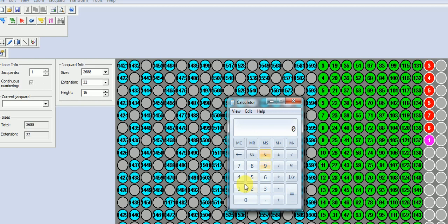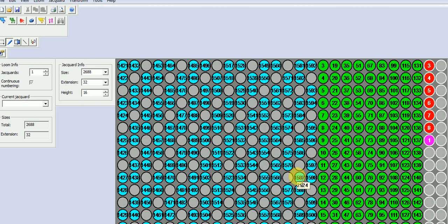84. Same, 1600 divided by 14.2 inches, you get 112 ends per inch for this. We also saw 800, divide with 14.2, how much you get? 56 ends per inch you get. Like this you can calculate, and you can easily cast out your jacquard without changing the harness and wasting time. You can easily save, and you can easily change the jacquard if you know this process.